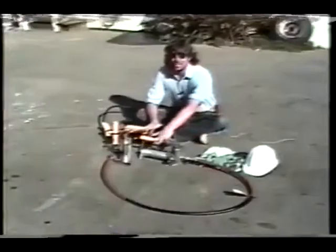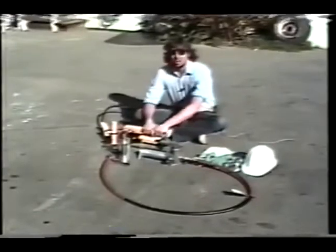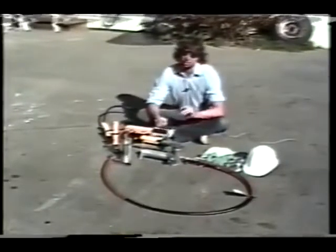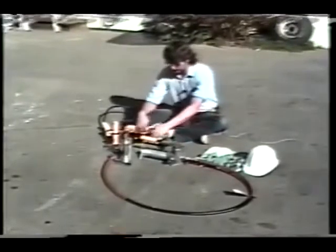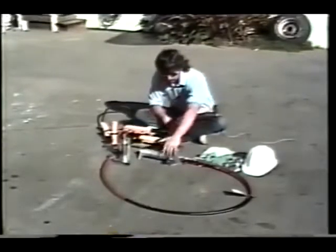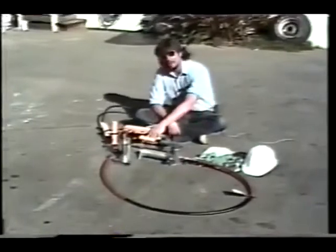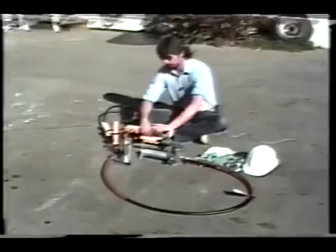These are an example of state-of-the-art opening tools. They're designed for emergency opening situations. They work well for that. They also work well for normal opening situations. These two tools are very similar in nature. They're hydraulic openers. This one is called the HydroForce and is made by Iowa American. This one is called the Rabbit Tool, and it's made by the same people that make the Jaws of Life.